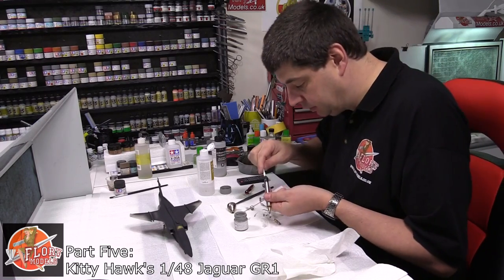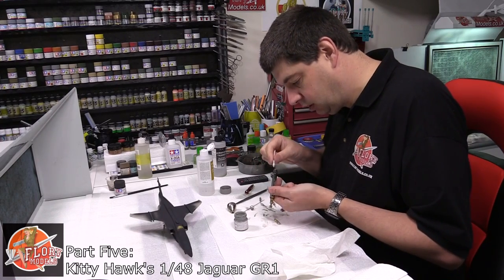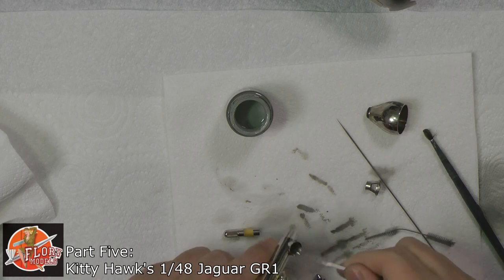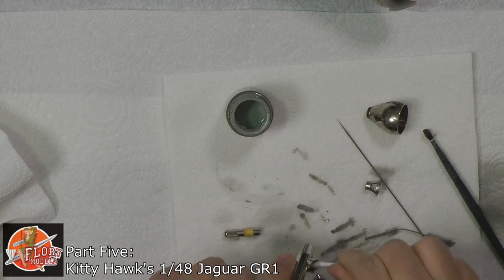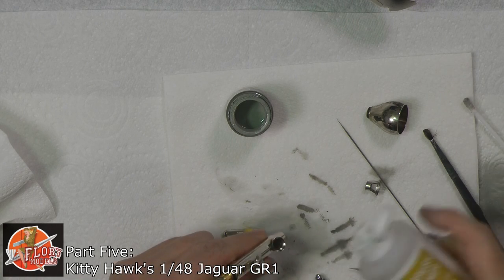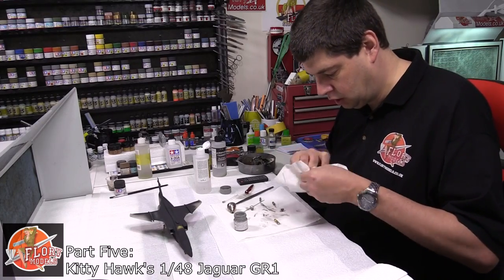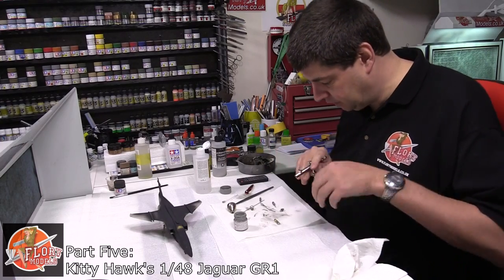Come in with a cotton bud, just round around the threads on the front end. All right. And just in around the top here. Good quality cotton buds as well. Don't use the cheap nasty ones, because the fibers can come off. You might see all these bits on here, and then they get down near your needle and they can cause your needle to keep flowing, perhaps when you don't want it to. Okay, so there we go, good flow down, everything else.